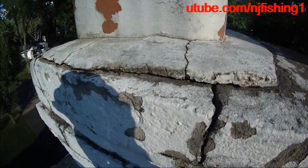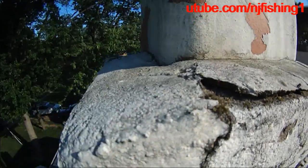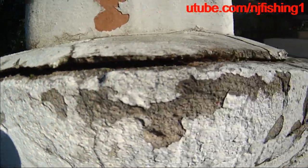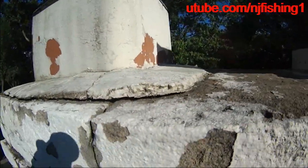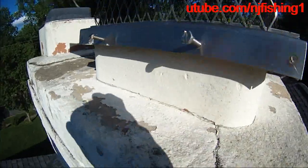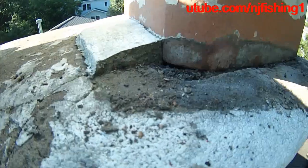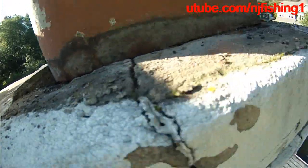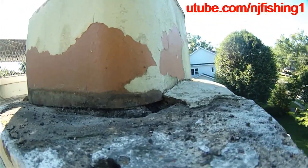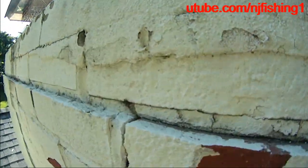You can see the concrete around this chimney crown is actually cracked open. I'm going to try to seal it. The cement actually cracked open and I just slightly tapped it from underneath the cracks, and the cement just broke off. That's why I'm getting water seeping down into the house and destroying my drywall. So that's why I'm going to be sealing these.